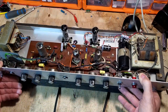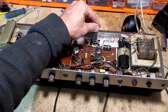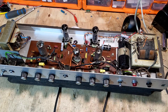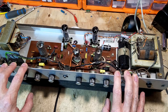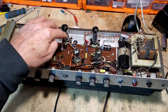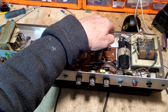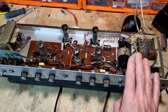Once I realised it was the treble cap, I knew exactly what was wrong. The capacitor was intermittent - when I moved it we lost the voltage on the grid. I swapped those caps and also swapped all the 100k plate resistors because some looked iffy - put in metal film one-watt replacements instead of the originals which were half-watt. I swapped the tone stack caps on the other channel as well. You don't normally find mustard caps or Wima caps leaking - maybe damp got in, or the amp just has long hours.